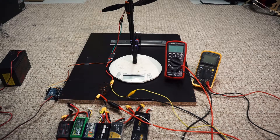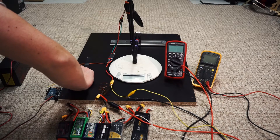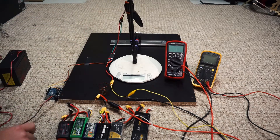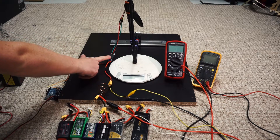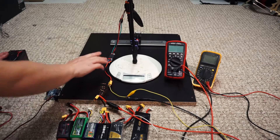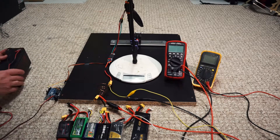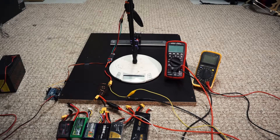The second thing I've got is a much larger motor. This is a Multistar 3525 850KV spinning a 10-inch prop, so the thrust is going to be quite high. I've got a 40-amp ZTW Spider ESC — no problems there. Both of these stay cold during the test, so that's repeatable as well. This is a lead-acid battery just to power the Arduino, so it's completely independent.